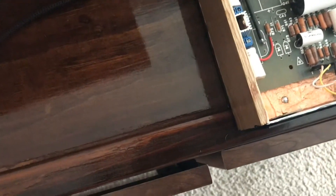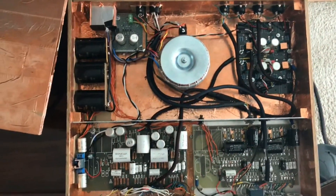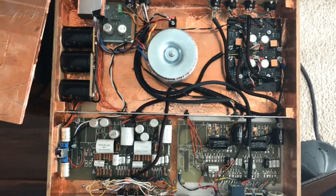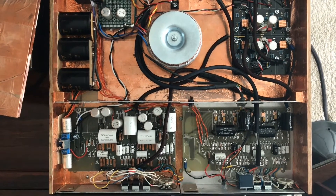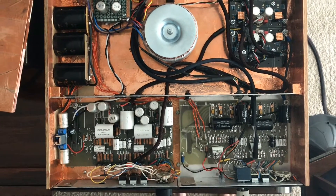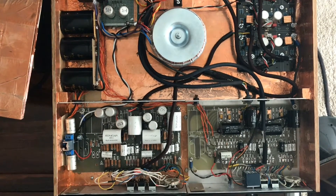As you can see, inside of here is pretty familiar but at the same time a lot better looking, a lot more cleaned up. What I've basically done is I took the dog's breakfast equalizer, cleaned it up, cleaned up all the capacitor wiring, and cleaned up how the capacitor banks were set up for the 20 volts, 18 volts, and 16 volts.